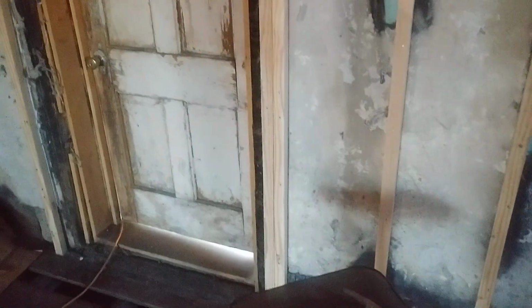And then I'll have an electric dryer hookup on the opposite wall next to the refrigerator. I'm going to replace that door. All the home runs for the electrical service will go to a 200 amp box on that little wall next to the door.